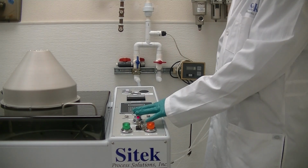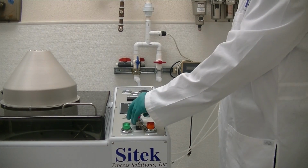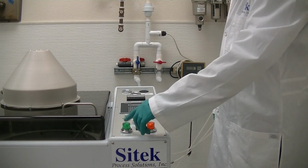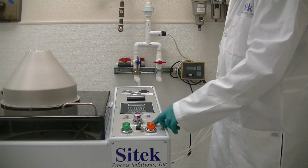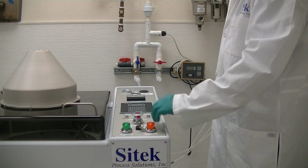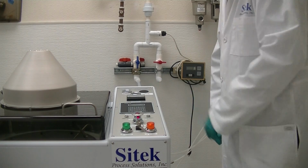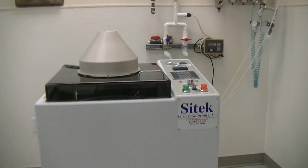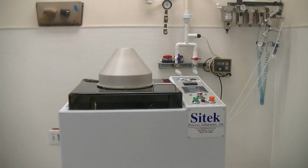We have the EMO switch, which is actually the power on and off also. We have door open lid and we have cycle start. This keypad is in operations mode or PLC access. We have it in operations mode. If it's in PLC access, you can go through the PLC controller. The manual has full programming capability that we supply to the customer. The system, which I'll show you down below.